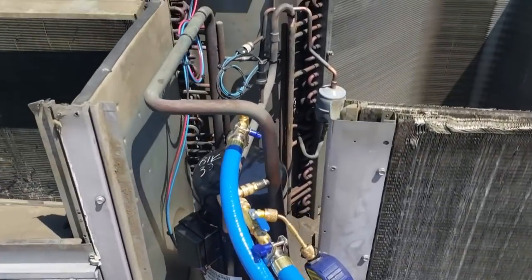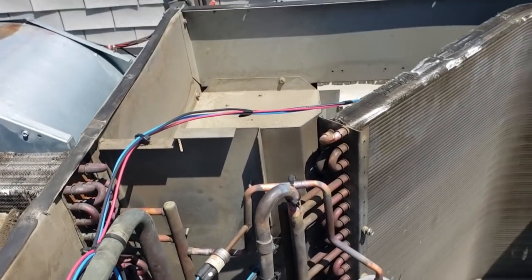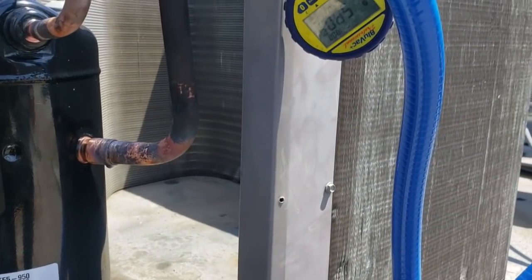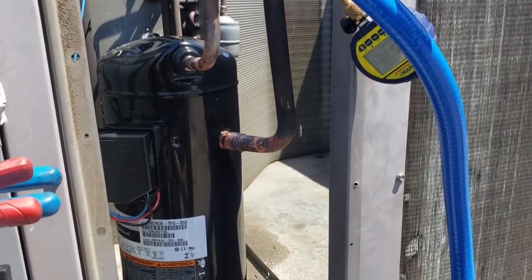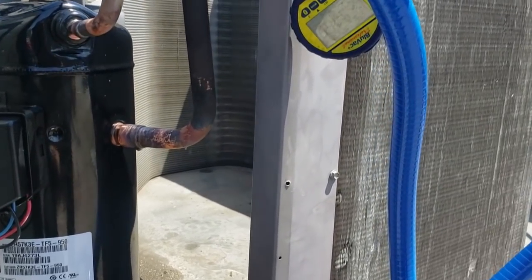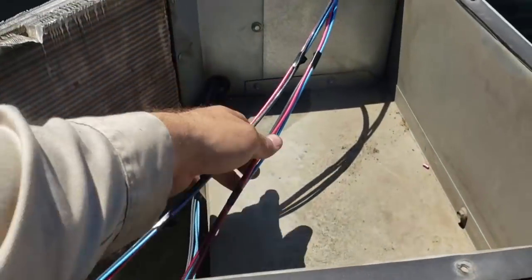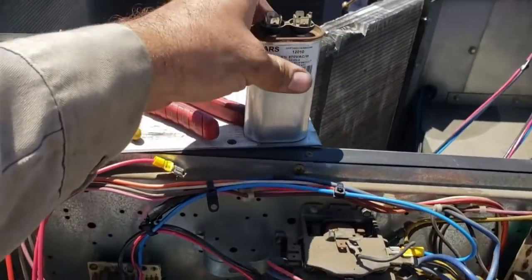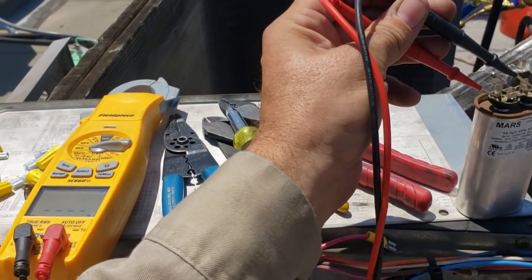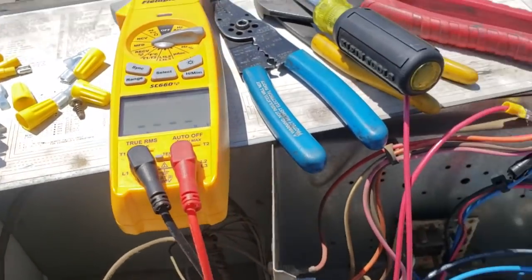Still pulling the vacuum, doing some electrical. I ran new 12-gauge wire for the compressor — same gauge as the other stuff — making sure it's secured where it's not going to rub out on anything. Our vacuum is doing good, at about 580 microns. It was stalling around 610-615, so I went ahead and did an oil change and it started dropping right after that — definitely needed that oil change. I'm going to go ahead and change these contactors. Testing this capacitor — it tests bad, reading 5 microfarads when it's supposed to be a 15, getting inconsistent readings. So we're going to change that.